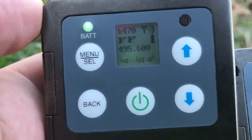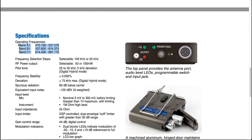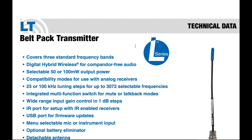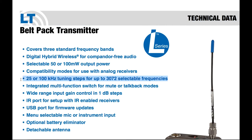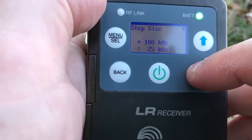What kind of sets these things apart? These can tune across a 75 megahertz frequency range. If you look at their website, there are three different tuning ranges: A1, B1, and C1, and the website shows you exactly what frequencies those are. Within each one of those frequency ranges, you have 3,072 selectable frequencies — that's a lot — and you can tune between those in either 25 or 100 kilohertz steps.